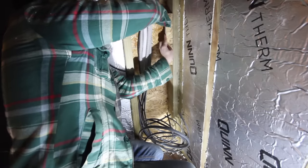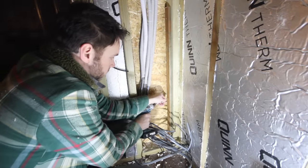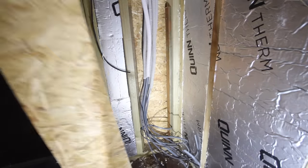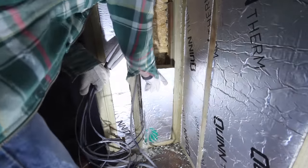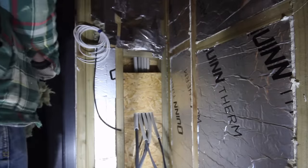The last job to do was around the consumer unit, the position of which will be below the existing noggin, so my electrician told me he needed something to secure it to. First I cut a piece of OSB to the right width, then used some offcuts to mark up where the backside of the OSB will be when it's in position. I still have some red cedar battens from the floor, and I used them to attach to the studs on each side, lined up with those marks. The OSB was nicely flushed with the inside walls, so I marked up where the cables would need to come through, remembering that a consumer unit needs to be a minimum of 45cm from floor level, and cut a hole with a drill and jigsaw. Next I cut the PIR insulation to size and threaded the cables through the hole and secured the OSB to the battens. The bit above, where the cables come out, I couldn't fit PIR insulation, so I instead loosely filled it with rock wool.